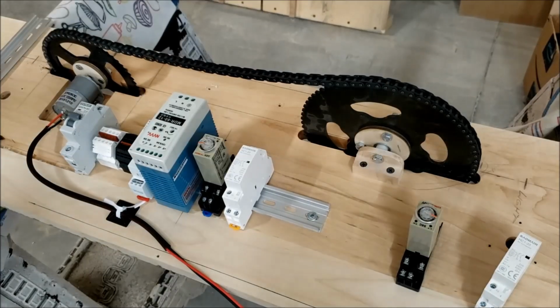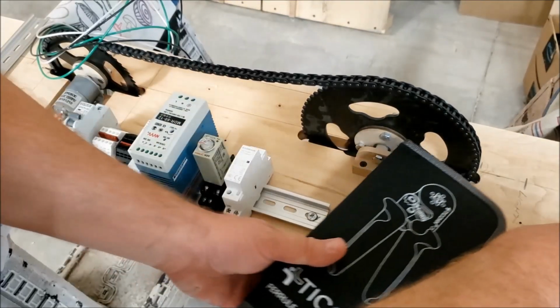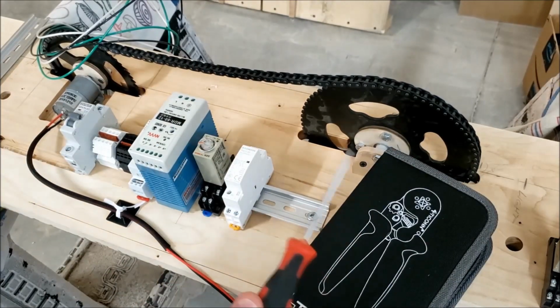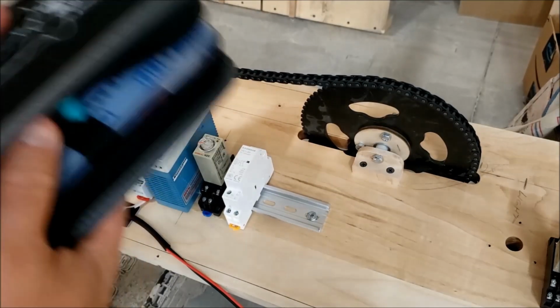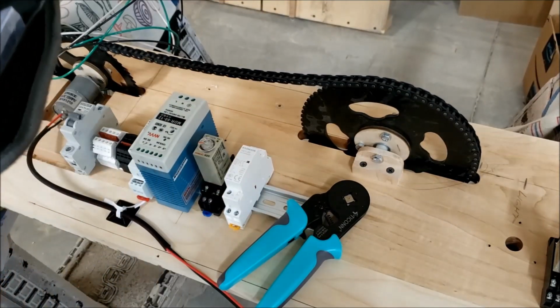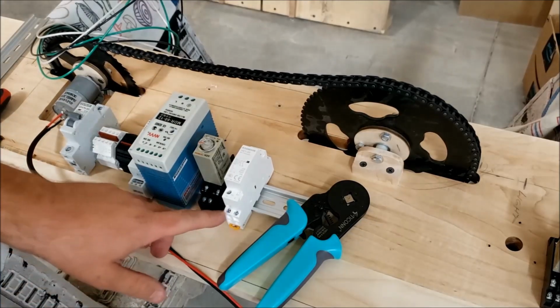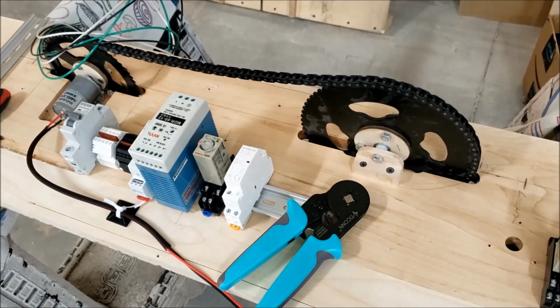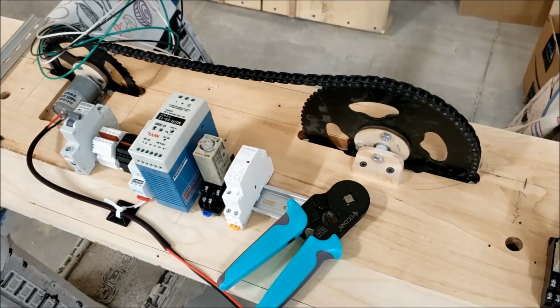Yes, brings me to the next point. Wire ferrules, I don't know. These things, while technically not required on code in the US, it is still a good idea to use them. Especially since I'm using the stranded wire. When the little clamps on these things clamp down on it, it kind of destroys the wire. It doesn't really make a good connection. So I'll be using ferrules, whatever, where needed, or everywhere. We'll see where this takes us.